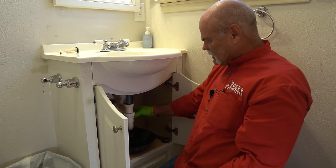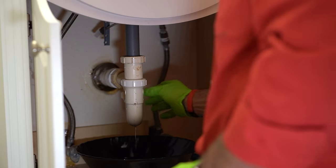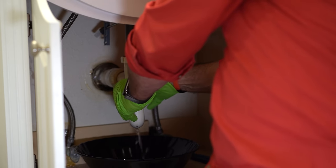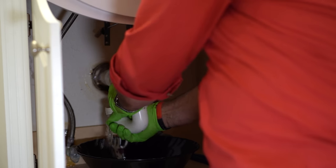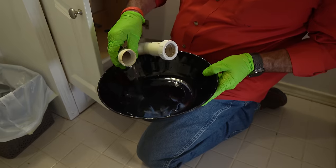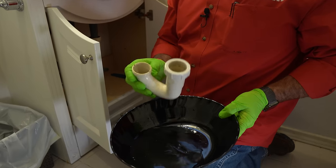As you see, the water starts coming out because it's taking the water level down to the bottom where the opening is lower. Now we look right here — if there were anything in here it would get caught right there. The inside of this P-trap is clean, so we know we don't have any problems. I'm just using this as an example. To be honest, I don't think I've ever gone into a house and seen one quite this clean.